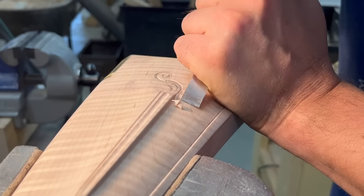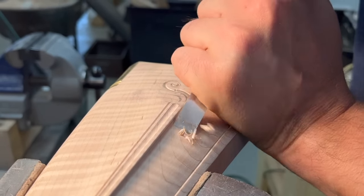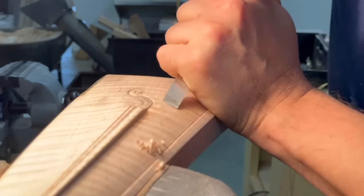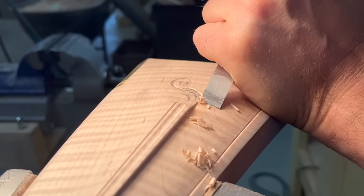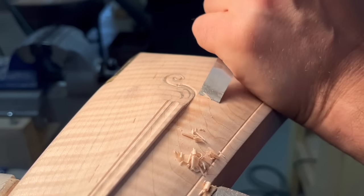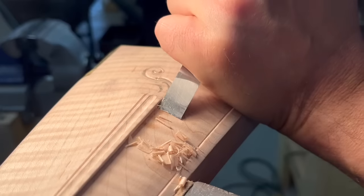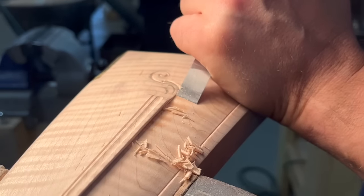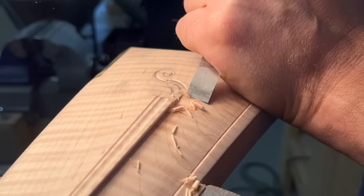This is being a little unhappy cutting in this direction — by unhappy I mean it wants to pop and tear. You want everything to be slices you control, not the wood tearing on you. There's often a preferred grain direction to cut. I can tell by the growth rings and also by the shininess of the cut. Curly wood by nature is a little trickier to cut because the grain is wavy. But there still is a preferred direction. Frequent sharpenings help.